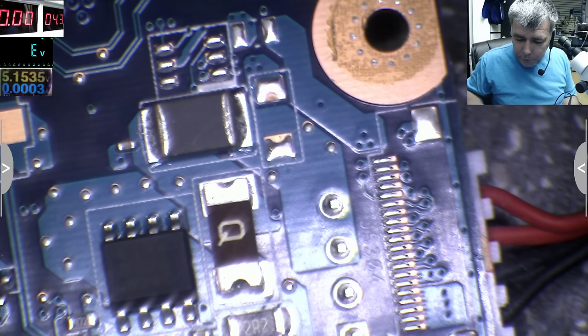Okay, let's just test it. Let's plug the connectors. Charging port. Charger. Power up. It's okay, the cable is plugged. Now we have the lights and the laptop is on, so you can see the LED lights. The RTC battery is low. That's the BIOS battery, so probably the BIOS was reset before. That's why it's saying that.